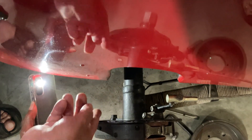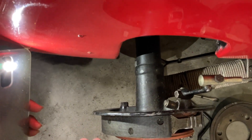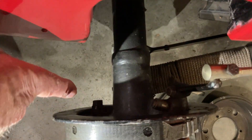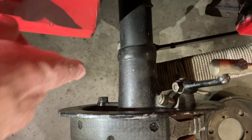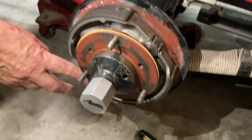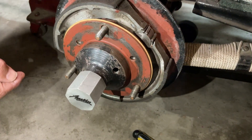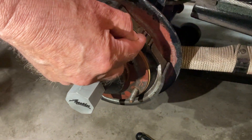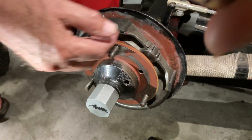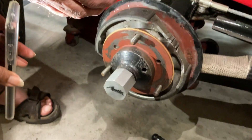The reason for that is you can then unscrew it and take the cotton reel out, and you can make different size cotton reels depending on how much you want to expand the braking system — the shoes in the drum. The next thing you have to do is cut the ends of the brake shoes off, so at the bottom of the little dip in the brake shoe it has to be machined off flush with the business end here where it operates, so that the shoe can slide back and forth. That makes it self-centering in the drum.